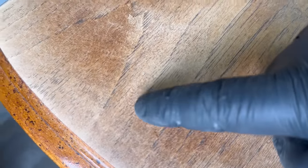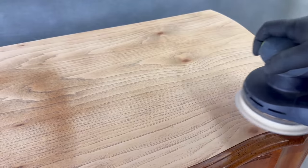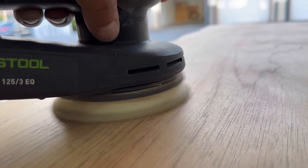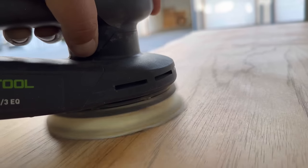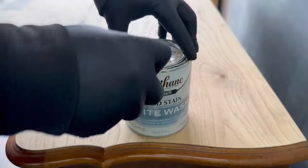This is a good example of those pigtails — you'll get a lot of swirl marks when you use an orbital sander with a really rough grit of sandpaper. The reason you don't want those is when you go to stain, the stain is going to seep into those pigtails and deep scratches and you're going to notice them a lot — it's going to look terrible. I've made that mistake plenty of times. Take your time, sand it right, and get it done right the first time.